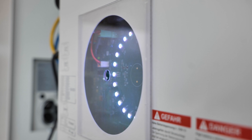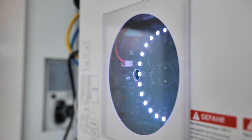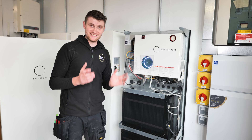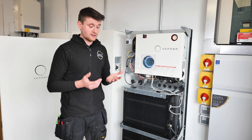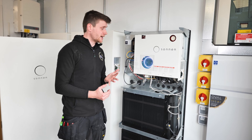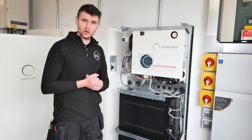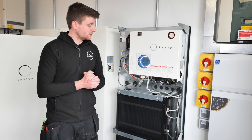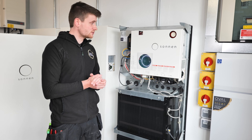There's an LED on the unit which gives that nice blue-white light you can see through the cabinet doors. Blue means everything is okay. Yellow means the internet connection has been lost. Green means the grid has been lost. Red means there's a battery problem. That's the colour coding, and other than that, there really isn't much more to see inside the Sonnen battery 10 — it's a nice, straightforward unit to install and deal with.